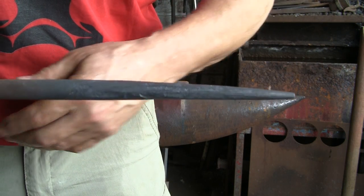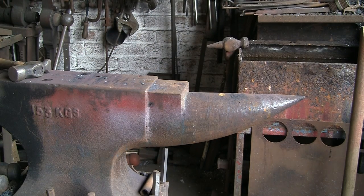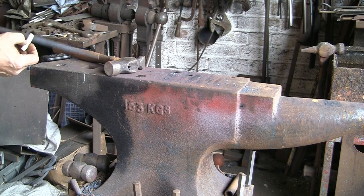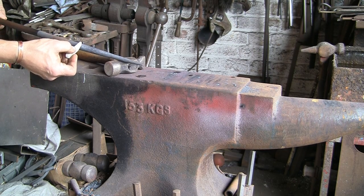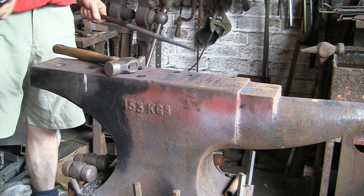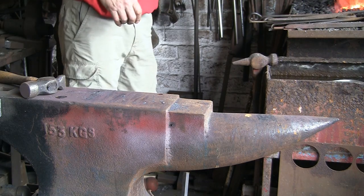You can see it's almost got all the hammer marks out — there's still a few in there, but as I say, it gives it the handmade look. The other thing I want to do is, once I've done the first one, put a chalk mark on the anvil as to how long it's going to be, so that when I do the next one I'll know where I want the taper to run from, so that hopefully when you coil it up you'll get two very similar ones. You do it on your first one — you don't necessarily have any sort of measurements to go by, you just do it naturally, and hopefully all the others will follow.